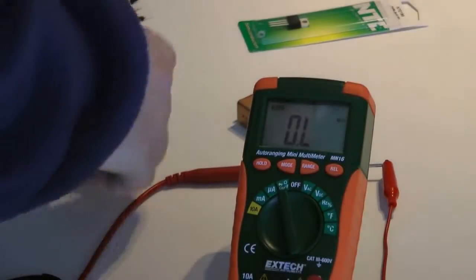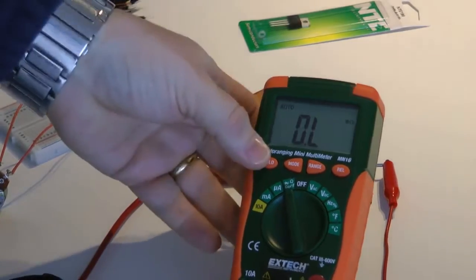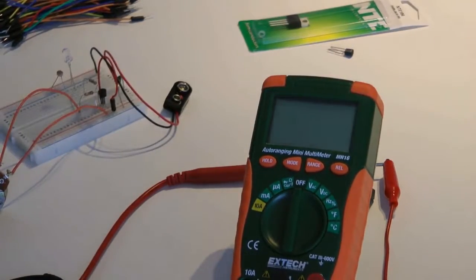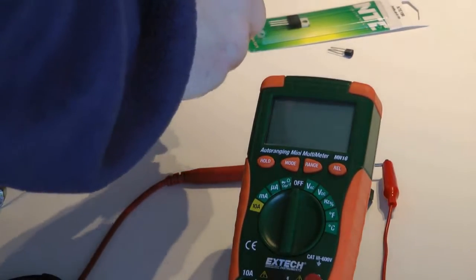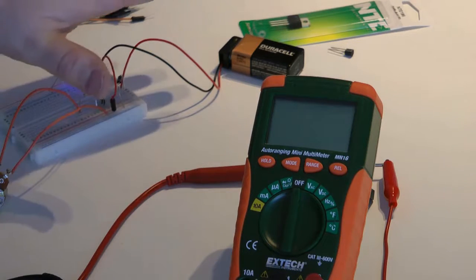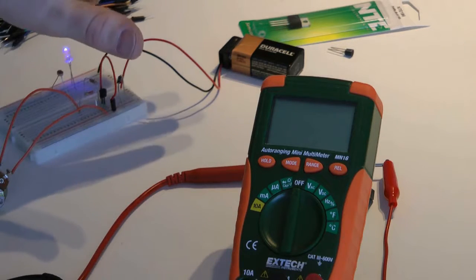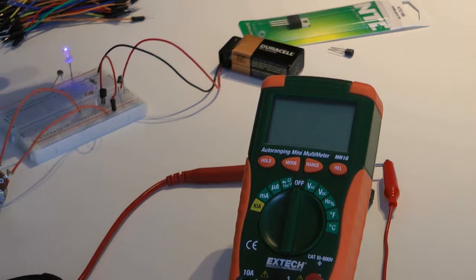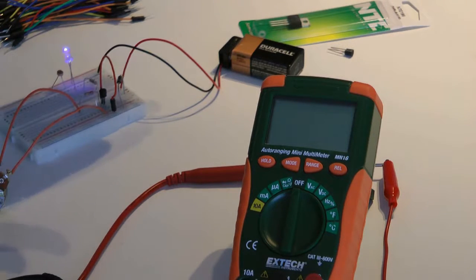Okay. We have built our little nightlight circuit. Let me shut off this. Okay. So now what I'm going to do is connect the power. And when I connect the power, actually the light came on when I connected the power. If you remember, we only used 500,000 ohms when the circuit called for a 1,000,000 ohm LDR. So it's a little more light sensitive than before.